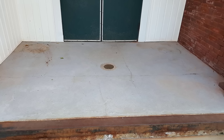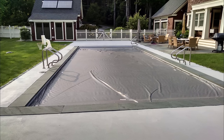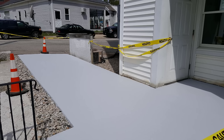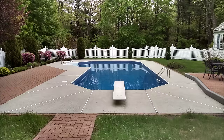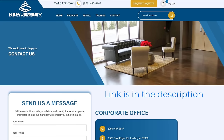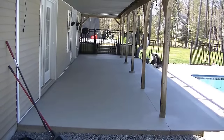Multiple jobs we've done like this — a tiny little entryway, a few little cracks in it, clean it, fix the cracks with a little bondo, two coats of paint, brand new again. This pool deck here was in really rough shape as you saw in the beginning. Just showing you some more pictures of what this stuff can do and what it can look like — a basketball court done in multiple colors, old pool decks looking brand new again. So MAPE Coat Deck T is the name of the product, and this is where you get it: New Jersey Decorative Concrete. You just call those guys, tell them what you need and what you want, how much square footage you have, and they'll help you out. Thanks for watching guys, we'll see you on the next one.